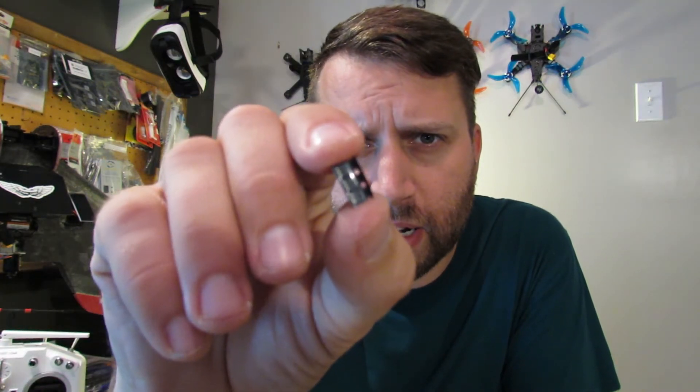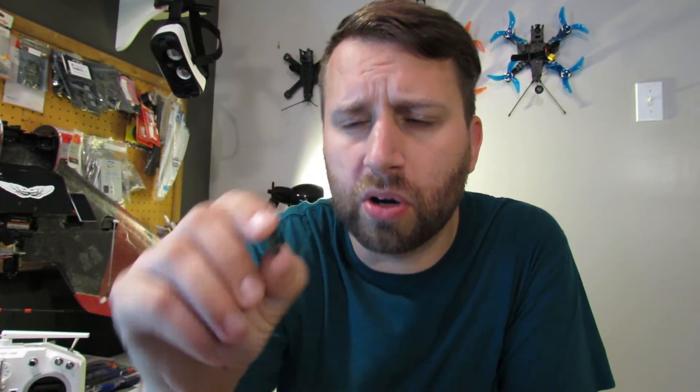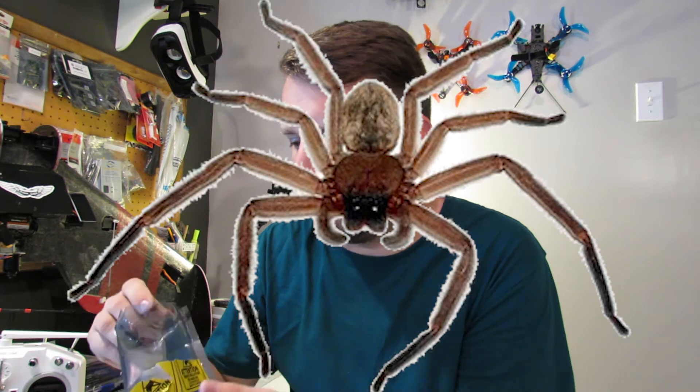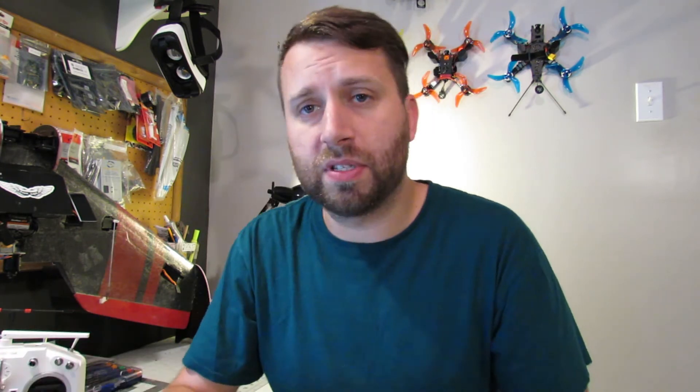The second option was to install this transistor. Let me grab one of these guys — right there. That's three of them. They're also very tiny and they have five little spindly spider-thin legs on them that you have to solder to. It's not easy. You're also then soldering wires to SMDs and stuff on the board.